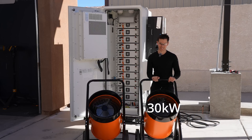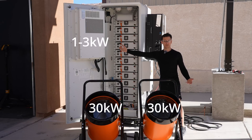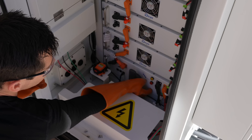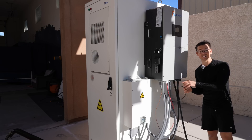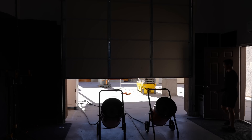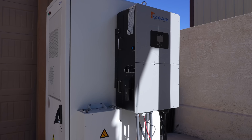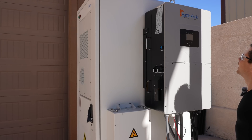This is a 30,000-watt heater and a second 30,000-watt heater. The battery cabinet air conditioner draws a couple thousand watts, especially at max output. Let's load the system up. First we turn on the battery using the switch, then the inverter, transformer on, solar disconnected, battery at 100%. The air conditioner is running. Moment of truth — we got an overload. It beeped and restarted. Let's disconnect the air conditioner and see if that helps.